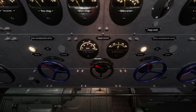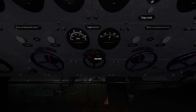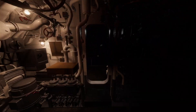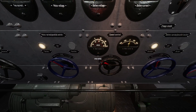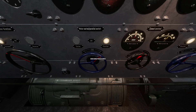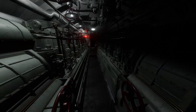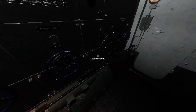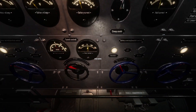Let's say we need to go to full speed ahead from slow speed. You're going to bring this over to parallel — but we need to bring up the RPM first before going to parallel, because at only 60 RPM as soon as we switch it, it'll trip. Think of it like a clutch. So head back in here again — 60 RPM, bring this up to the voltage we need, like 110 for example. Move to high, bring the speed control back. Now let's go to the port side because the starboard fuse isn't doing well. Power on, motor forward, and we're at dead slow.